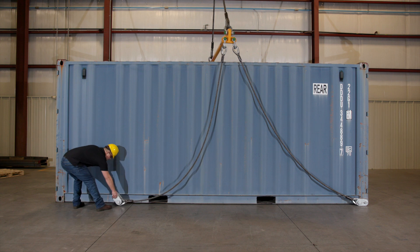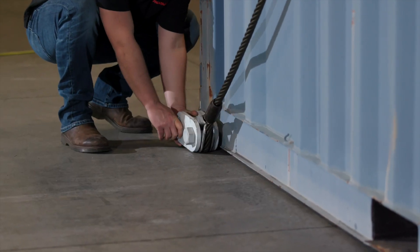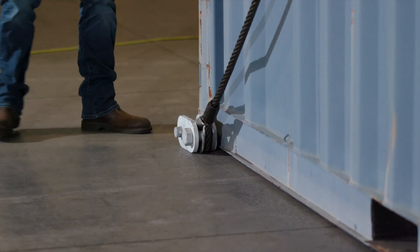When using these AK24 and AK25 sling assemblies, the TandemLock rotary lift lug is inserted into the bottom corner fitting side hole. The sling angle from horizontal must be greater than 45 degrees.